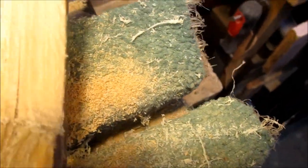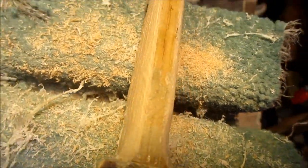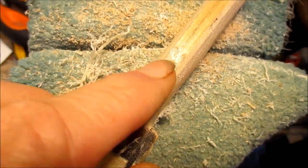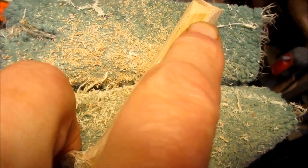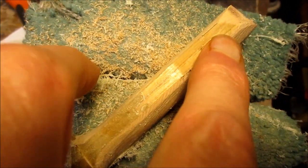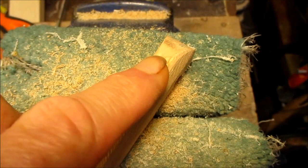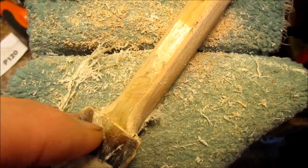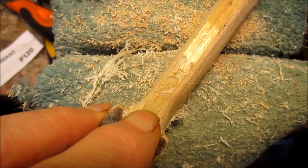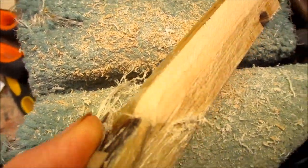What I have done is blended in the levers a bit more. That is still way too thick - looking at the pictures in the Karpowitz book, this belly edge of the lever is almost down to like a V, like a knife edge almost. But I've followed my usual adage of taking off half as much as you think you should - you've still got room to quit while you're ahead, and if you do too much then it's hard to backtrack.